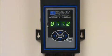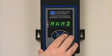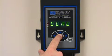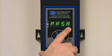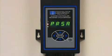Another alarm condition would be if a sensor failed. I'm going to simulate a sensor failing by just pulling the pressure transducer off of its connection, and it gives you a pressure alarm. If I try to clear this alarm by going into the manual mode, going to the alarm status, and trying to clear the alarm, you will not be able to clear it. The reason is that this alarm has no time base to it — as soon as the sensor goes bad, there's no time delay before it gives you the alarm. So as soon as I clear the alarm, it will pop right back up.